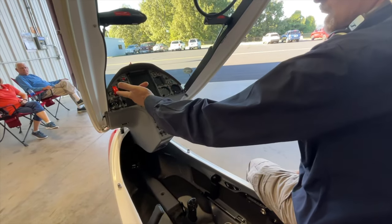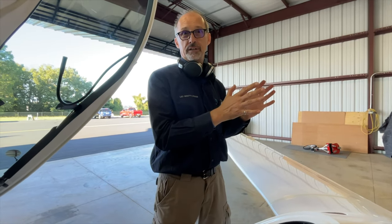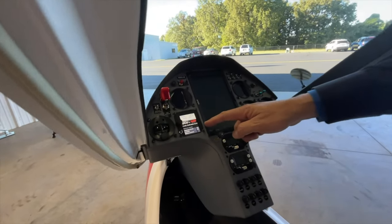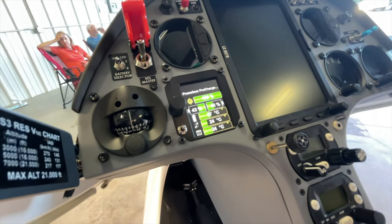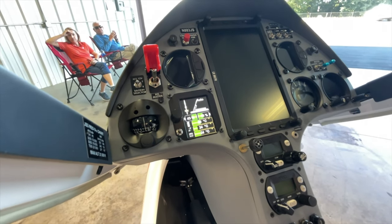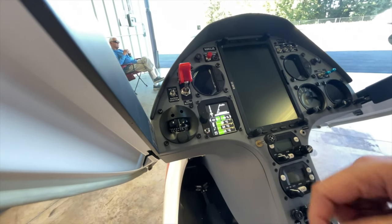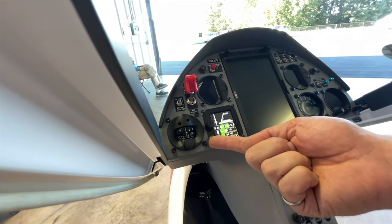Whether it's up or down, we can go right into auto mode. This one's designed so that if you boot it up, it's going to stay where it is because it doesn't know if it's safe to retract. Flipping it on, it checks the retract mechanism, battery control, isolometer, and all those things. Then it does a power bus pre-charge — you can hear the motor kind of humming. That's the centering. The icon shows it's centered, and the pylon is showing partially up. I'm going to bump the toggle switch once up and it should raise all the way.